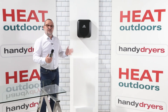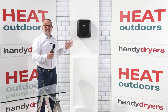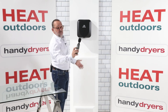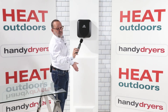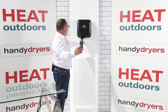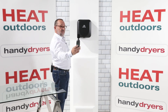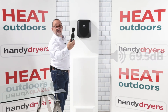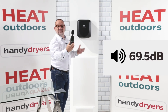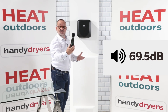So we're going to do two sound tests now. The first one is to test the Armadillo when it's on full power — it's low noise even at full power, but let me show that to you. We've got our sound meter here and we're going to hold it around a meter away from the machine. I'll set it to take the maximum volume. 69.5 decibels — and that is its maximum sound. Anything under 70 decibels is what we'd classify as a really low noise unit.